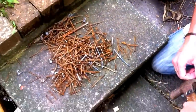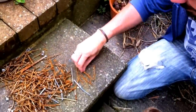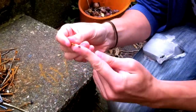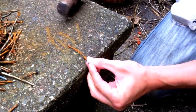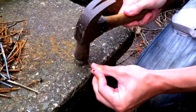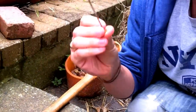Carry on doing that for another three more pallets. Once you strip down the pallets you'll have a whole heap of nails. You might get a couple that are fairly straight but nine times out of ten they're going to come out quite curved, so all you need to do is straighten them out. Get the top end down with the arc facing upwards, and just gently tap them with your hammer. Don't use too much force because you're weakening the nails. Try not to hit your finger and they'll come out a lot straighter and you'll be able to use them again.